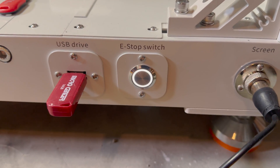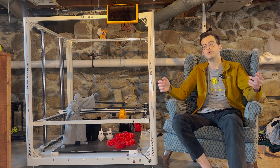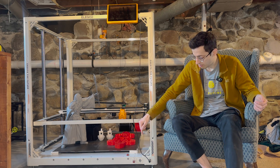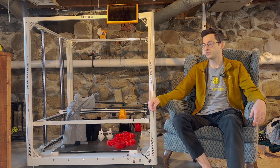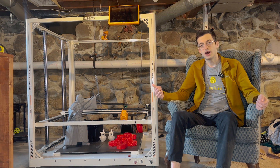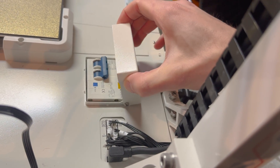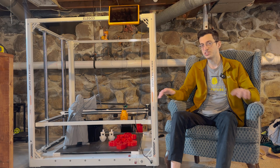Also, this emergency stop button isn't actually an emergency stop. Normally an emergency stop cuts power to the device, but in this case it simply resets the firmware. My wife claims the print head kept moving even after she pressed it. Additionally, when I first got this printer, I thought it was dead on arrival because when I flipped the power button, nothing happened. After about 30 minutes I discovered a hidden circuit breaker that also had to be turned on — and that breaker wasn't mentioned anywhere in the instructions.